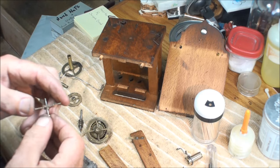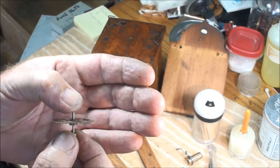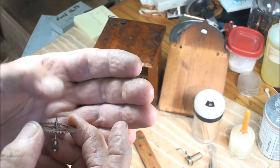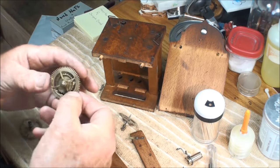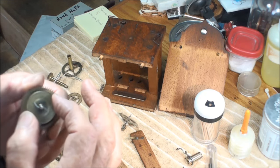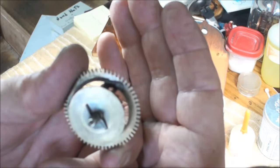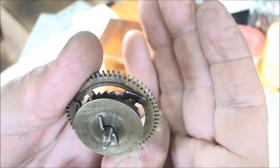And also I've noticed, for example, on this one, see how large that is right there? Look how small that end is. As far as I know, your nowadays clocks, whatever size is here, is also on here. On these, I oiled down the shaft because that's the only part that moves. On the clicker, I oiled where the pin is. And I oiled under the pin, the top of the pin and under the pin.